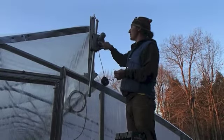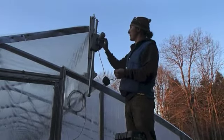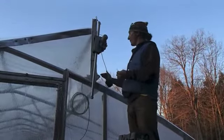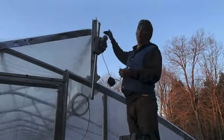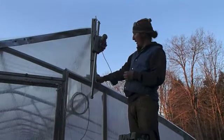You'll see 2 limit switches here. There's a screw in each one. If you release that a little bit, you can turn these blue dials, and that will set the limit for up and set the limit for down. We'll set the limit for up, but we're going to use a separate limit switch, which maybe you can't see from there, but we'll talk about in a moment, down here.